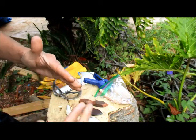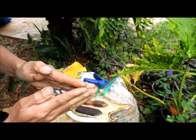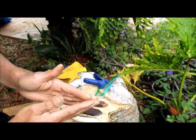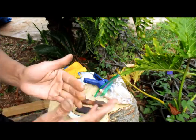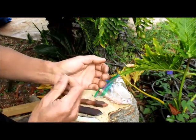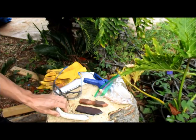Therefore, really thin. So if you put lateral force on anything that thin, if it's really hard, it would chip. And if it's really ductile or soft, they call it tough, but actually it has certain ductility able to give, it will give before you exceed the ultimate tensile strength of the material, then the fracture happens. But if you have aluminum, then you can keep bending because of the ductility, it keeps rolling for a long while, unless you pull back and forth until you work harden it and weaken the hinge where the metal transitions back and forth.